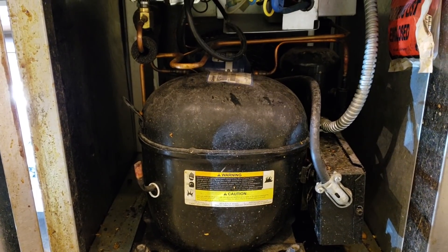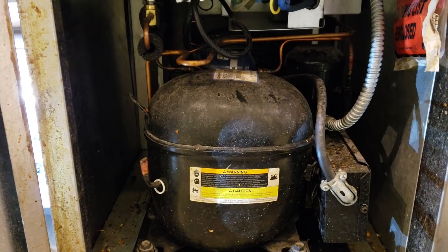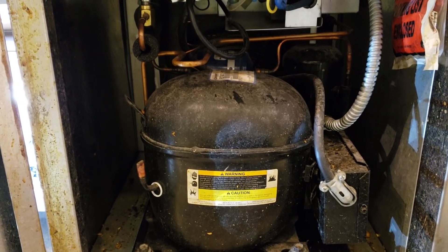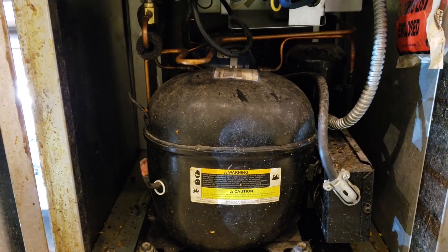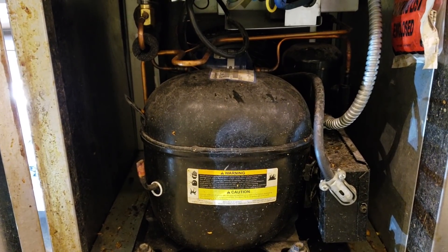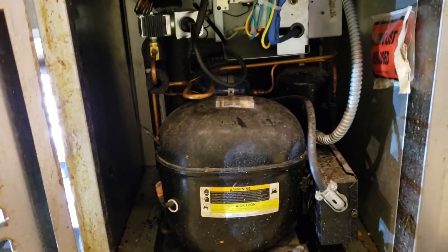Tech support just asked me, 'How do you know you're not low on refrigerant?' I said it's acting like it's pumping down because my refrigerant pressure was staying the same. He said, 'Put a little refrigerant in there, see what happens.' Sure enough - put some gas in there and that was it. I went in with the notion it possibly had a bad pump because I've had history with the pumps failing on these.